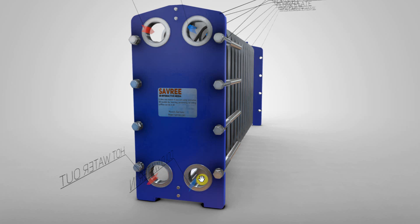Conversely, if we take a hot fluid and put it into the heat exchanger — as seen here on the upper left side — then we're going to put the fluid in at the top and out at the bottom. Because as the fluid cools, its density increases and then we can take it out of the bottom. So there's no point trying to fight the laws of physics, because if we do that, we're just going to waste energy.